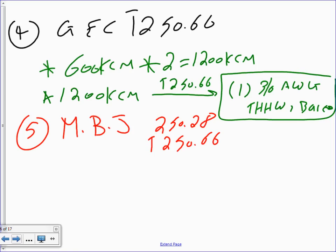But if you exceed it, you can't land it. For example, number 4 cannot land on the receptacle lug, even if you want to. The creative people like Darren, what do? Because it's stranded, they chop a couple of strands out of it, and they leave one, and they just stick it in there. Oops. Anybody have done that?